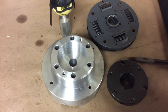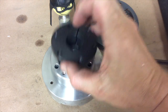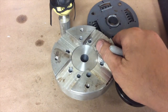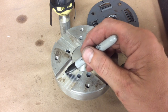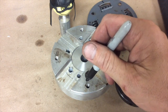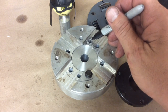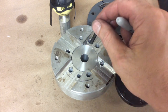We're almost done. Everything looks real good — the QD coupling fits real well. Our bolt holes are drilled, cleaned up, tapped, and ready to go on this end. We do have to do a little bit more work on the lathe. We're going to have to chuck it back up in the four-jaw and center it and then trim out some material — a little bit of a clearance for the bolt heads that'll fit in here. So we'll have to whittle it down to give us enough clearance for all these bolt heads. These two holes won't have to worry about it as much, although they'll get clearanced as well — those are the holes we made for pushing that QD coupling out.